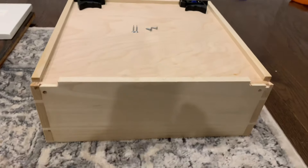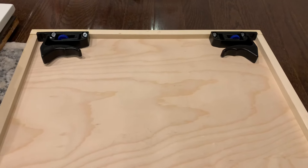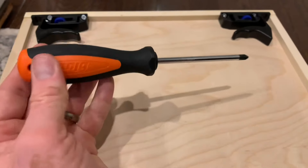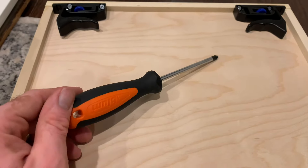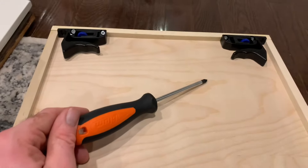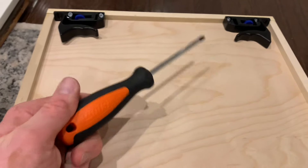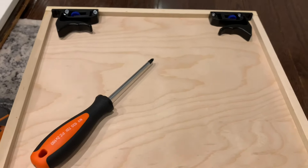If you want to watch the video on how I built the drawer box on my CNC, I'll include a link in the description. Now these are both screwed in. One thing to note is the screws they give you are Posi drive screws — they'll look a little different on the head. A Phillips can kind of work, but a Posi drive screwdriver works much better. These are used a lot for cabinet hinges, and Posi screws are almost impossible to get out when tight with a normal Phillips. Use the right kind of screwdriver.